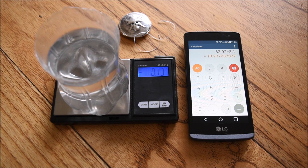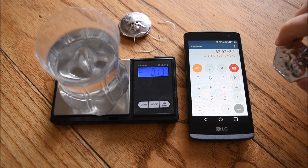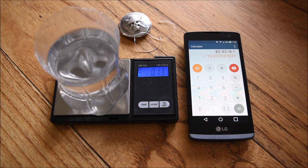You can see that's different to the 10.44 reading we got from the first one. That says to me right off the bat, this is not 999 silver. Now it's sitting well within the bracket for 925 silver, so I'm pretty confident that that piece is 925 silver.